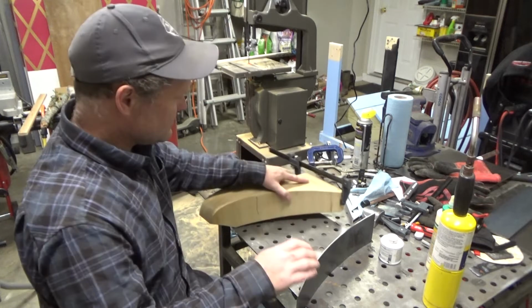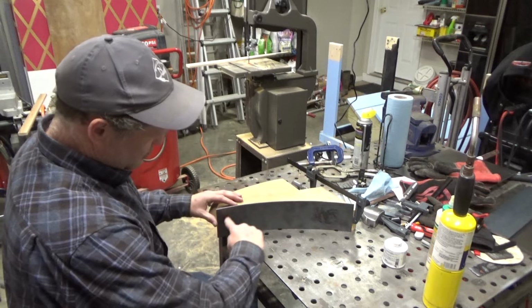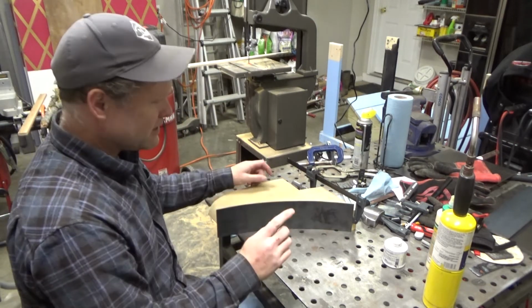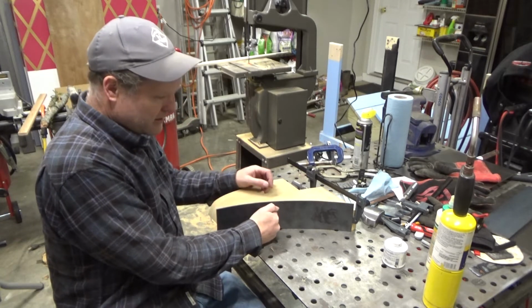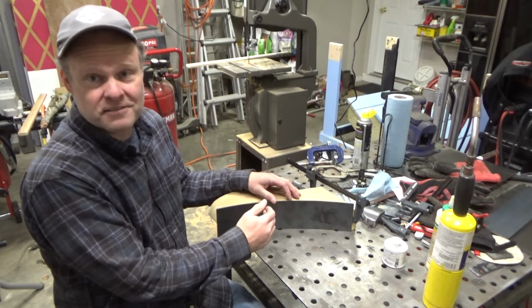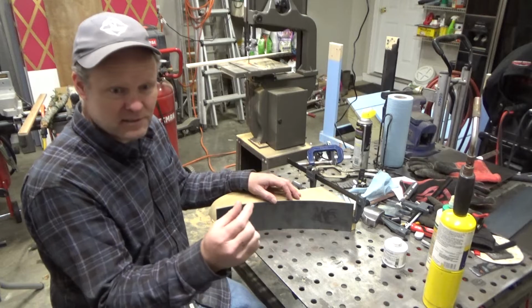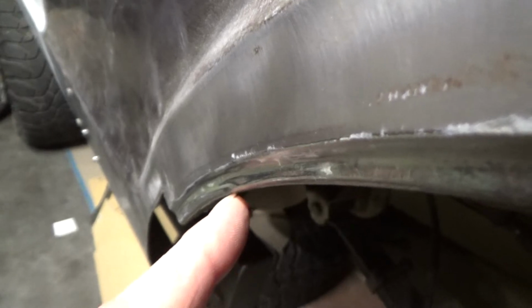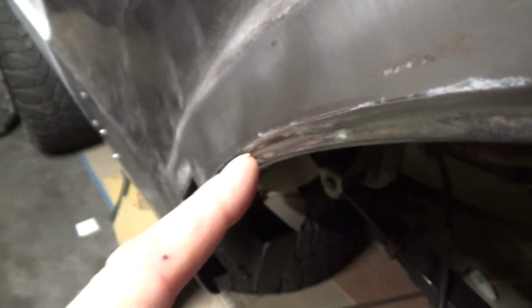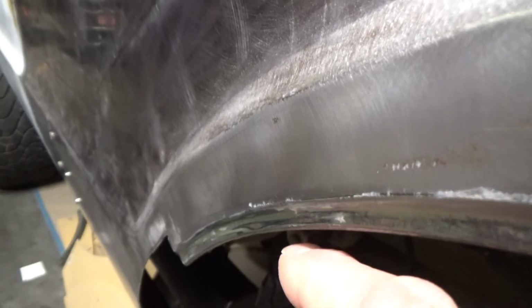You can see I've got some shears to cut this sheet metal to the profile I want, and then I've got 3 more pieces of 11 gauge steel that, when I stack them up here, give me 350 thousandths of an inch, or I think it's just a little bit over. Those are for this little bead or step down here, which is 0.35 inches between where this edge comes in and this edge is, so that's 0.35 inches on the inside.